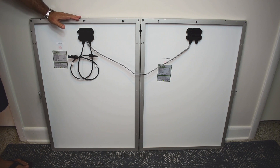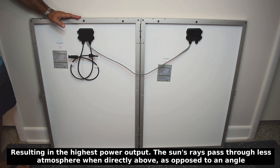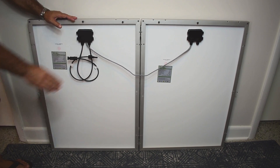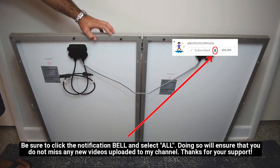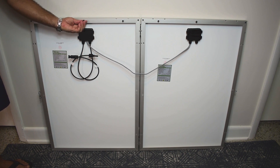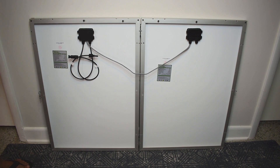The folding panel can be used two different ways. In summer I could lay it flat on the ground since the sun is almost directly overhead. Or, by adding an aluminum angle along the top edge, I can make the top edge extremely rigid and have an adjustment in the center to get the panel at any angle I desire. There are four bolts with a knurled edge so I can tighten them by hand or with a hex key to secure the aluminum angle.